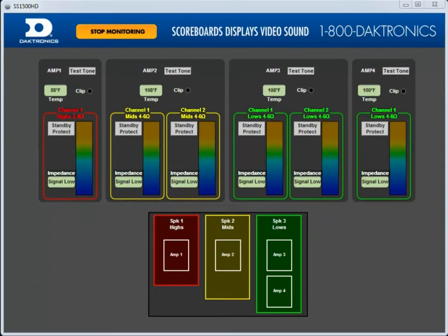Play full range audio through the system. Typically you would use a CD or MP3 device to do this. You will see the audio meters move based on the music content. Place all the amplifier channels in standby, then unmute one at a time and listen to make sure that you hear audio. This ensures that you can hear audio outputting out of each amplifier. After you have finished verifying the amplifier output, turn off the music and turn all your amplifier channels back on.